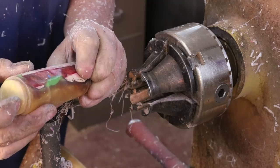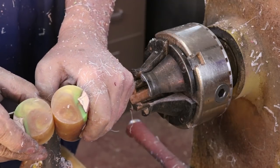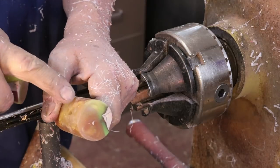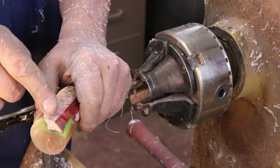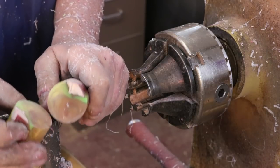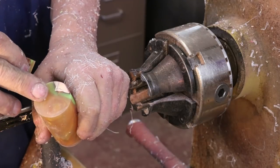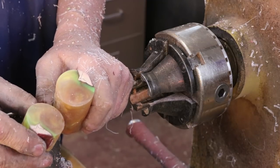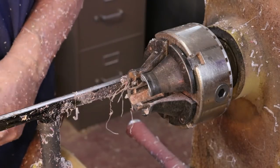I have an idea of the shape I want eventually. I need to put female threads in the cap and male threads on the base to connect them. I may run into a little bit of that burl, but I can fortify it with CA glue and thread that. I'm probably going to use a 20 TPI chaser — I ordinarily use a 16. I thought since this is resin it should take a pretty good thread. So let me chuck this up and we'll move on.